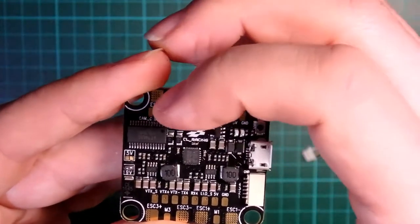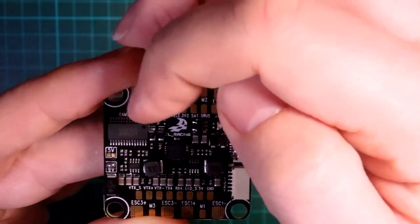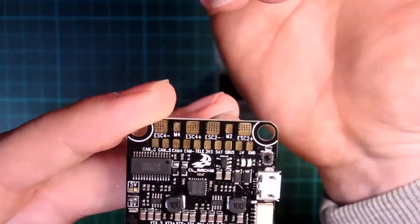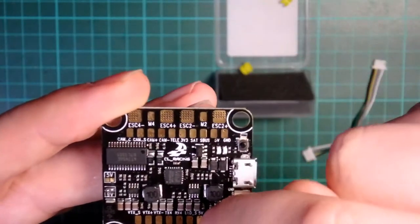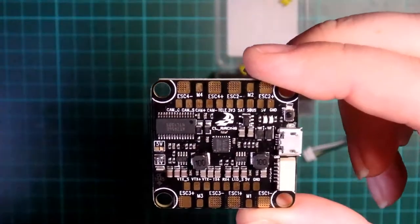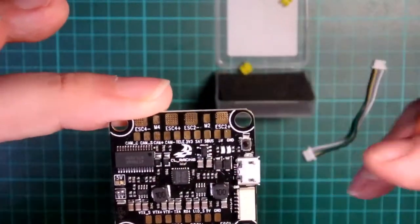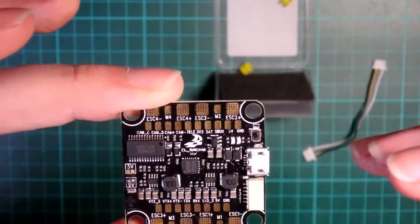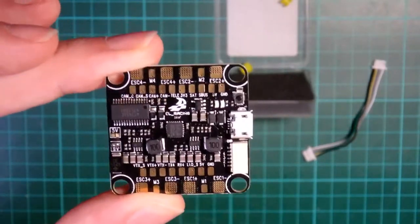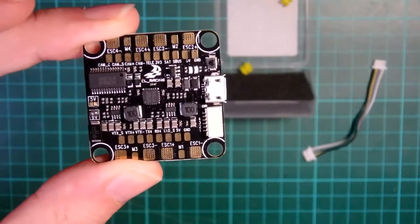As you can see from the pin layouts, we've got all the camera connections on the front — this side faces to the front of the quad. We've got all the camera controls here, which is great. The video from your camera comes into this end, passes through, and then comes back at this end to your transmitter. It also has LED outputs on there as well. There are a couple of camera control pins — I can actually solder on camera control, which I might do, but I'll probably do that as a separate video.